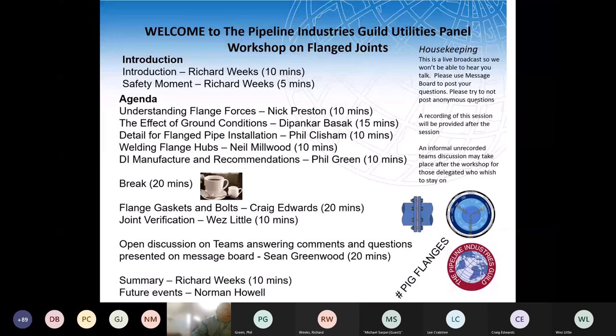Who on the panel wants to jump in on that one? I can give you a small answer on that one if you want. I think it depends on the gasket style used. We have some for EPDM and we also have some for steel rubber, but we must caveat that installation torque value with the inherent strength of the polyethylene stub and backing ring, and also paying a little bit of close attention to the geometrical differences between the two flanges. Quite happy to contact me directly at some point and I'll go through it all with you.